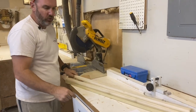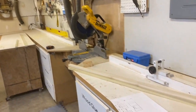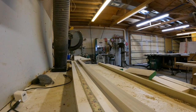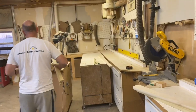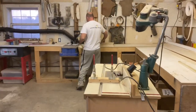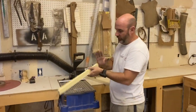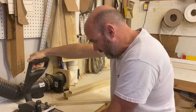And now I've got a 2-inch one because I want to hide that. I want to make sure there's nothing binding on my dead corner. Okay, guys. So I've cut that whole face frame out real quick. And now these are all my horizontal pieces, which will be the ones that I actually pocket hole. I'm going to go ahead and set this up.